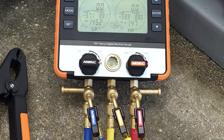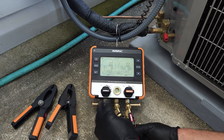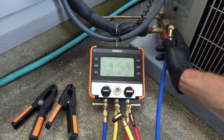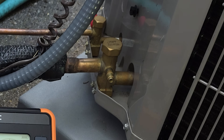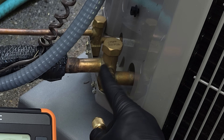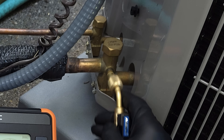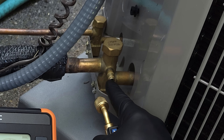When you are transporting a manifold and hoses you want to have these all snug. You don't want hot humid air getting in there. What we're going to do here is the air purging process — we're going to shut this one right here, open up this line, and connect this in. We're going to disconnect our port caps. If you are trying to connect in while the unit is running, this will be low in temperature and it'll attract humidity, so you need to do it quickly to avoid water condensing on the inside.